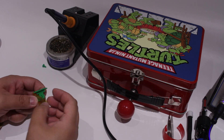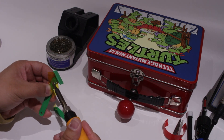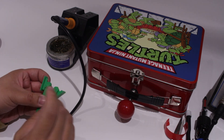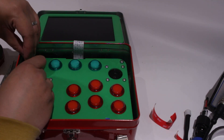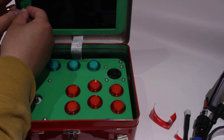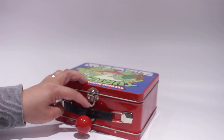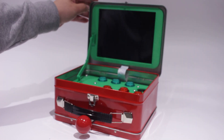The hinge is exactly the same — using a solder iron and Kapton tape, just be sure it's not rubbing against any plastic pieces when closing. And obviously the trickiest bit is sticking it on and making sure that the whole case closes without any issues. And with that, we're also complete with the Teenage Mutant Ninja Turtles Lunchbox Arcade.